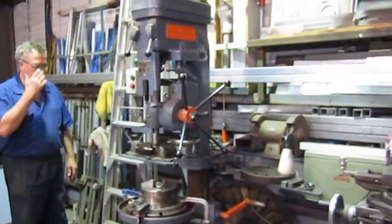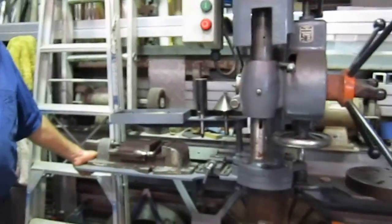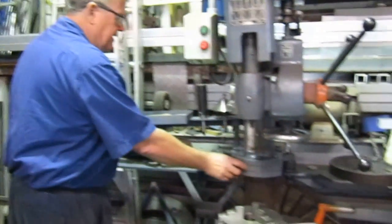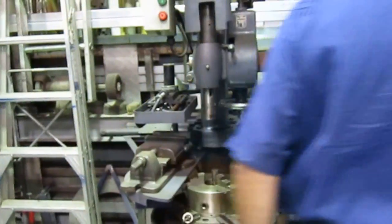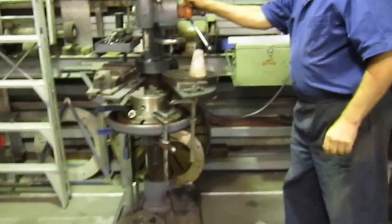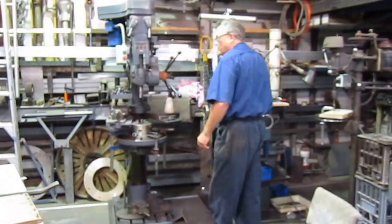Now this is an old Progress — an English Progress drill press — that has been tickled up by Fred here and he's added a few components to it to make it user-friendly. The first component he's got is this tray. It had a plate system here with a little tiny piece on it and I've changed that to a couple of wings which have got bearings on them, and the wings will close in out of the way. Now the whole machine is on rails so I can move it out of the way when I need to quite easily. And the same with the milling machine — that'll move along the rail as well.